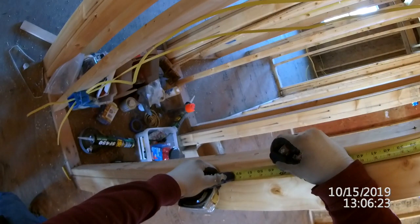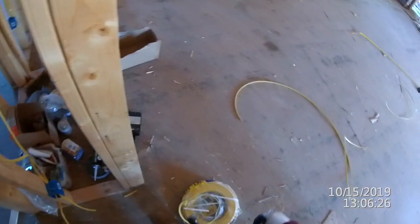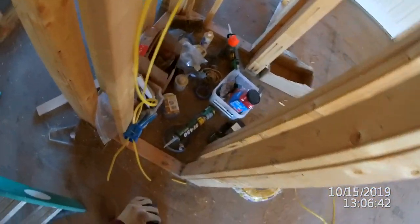When I do switches, I pull down 48 and 5/8 inch. That way when the top piece of drywall gets hung on the wall, it just breaks right above the outlet, which makes it easier for the drywall man to cut it out.